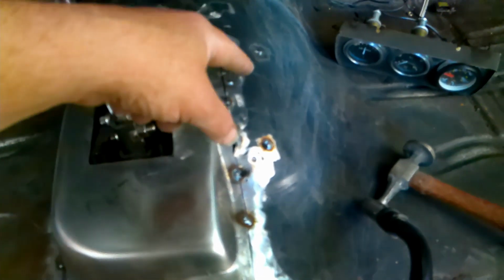Okay, so I'm not able to show you the weld. My arrangement to protect the camera kind of blocked the view. But for the time being, this is what we have. Something like this. I wanted to tack across from each other to prevent it from warping.